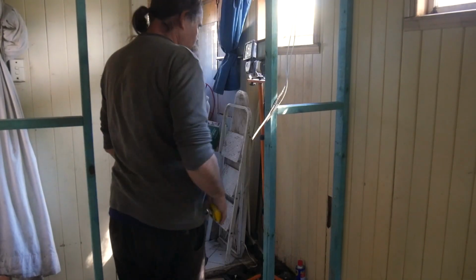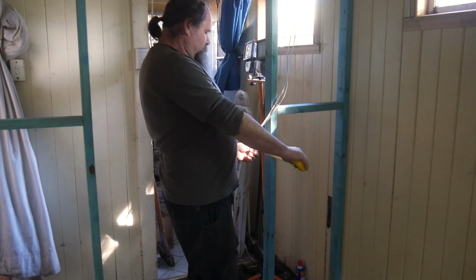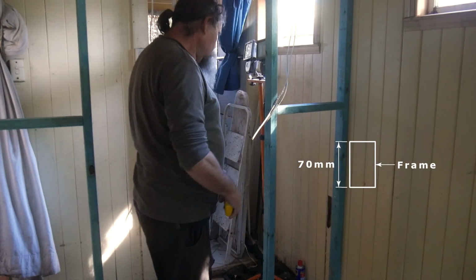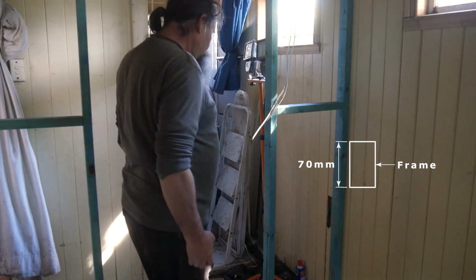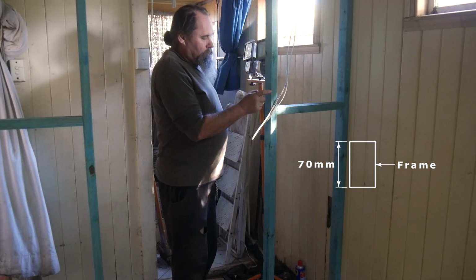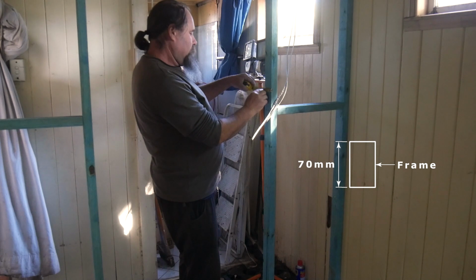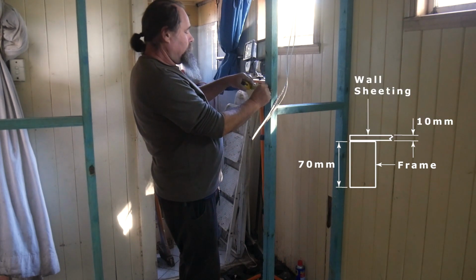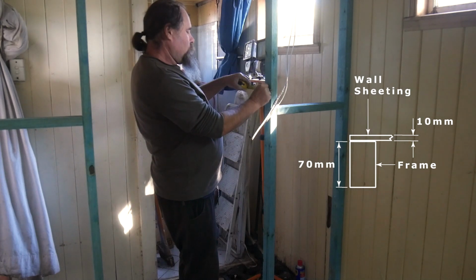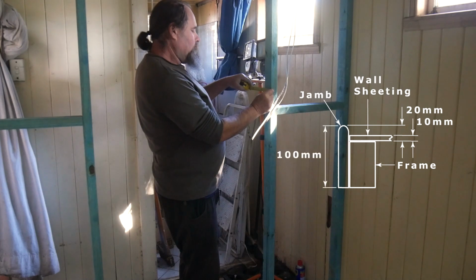Right, so for our door jambs, the timber is pretty well dead on 70 millimeter. So we want a piece of timber from there out to here, which will need to be 70 plus 10 for the sheathing, plus an extra 20 or so. So it needs to be about 100 mils